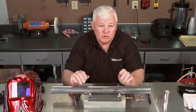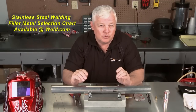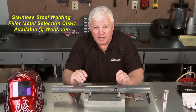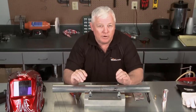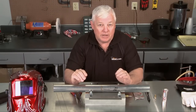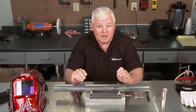Today we have some tubing here called 304L. There are certain filler materials that we want to use, but there's also a certain reason why we use 304L. 304L is good for most applications in exhaust — you'll see it in a lot of hot rods and high performance vehicles. But if you're going to be using it for several hundred miles at high temperatures — racing temperatures — then you're probably going to want to step up one notch and go to what's called 321 stainless. The reason behind that is 321 has high temperature stabilizers and it won't break down, nor will your weld break down. But you also need to remember if you use 321, there's a different filler material and that filler material is called ER347, high temperature stabilized.